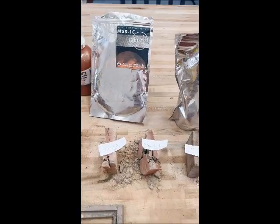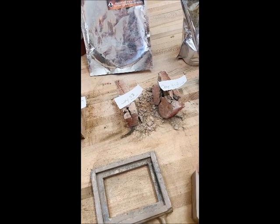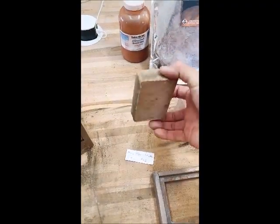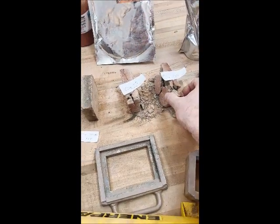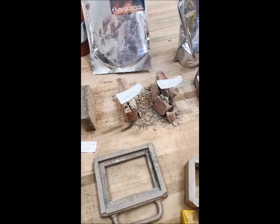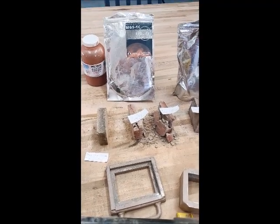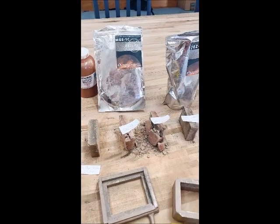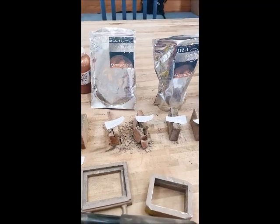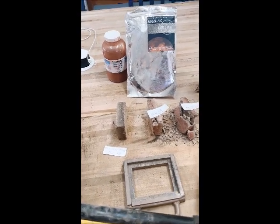With a clay type soil it's called lamination, where the block actually separates into layers if you push it too hard. That's what happened when we put 2,000 PSI on this clay simulant. We went back and made another block where we only put 1,200 PSI and got a much better looking block — same soil, just 1,200 PSI. We can't even test the over-pressed ones because they broke right into layers and produced a structurally unsound block. There's a range, typically 1,200 to 2,000 PSI. For a sandier, grainier soil with more aggregate and less clay you might go up to 1,900 or 2,000 PSI; for a clay type soil it might be 1,000 to 1,400 PSI. You've got to experiment with your soil and figure it out.